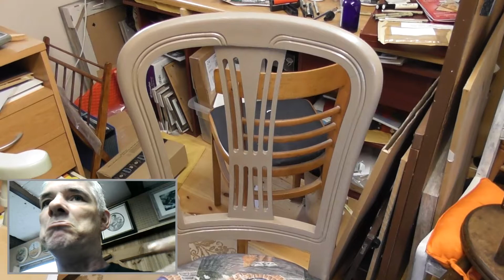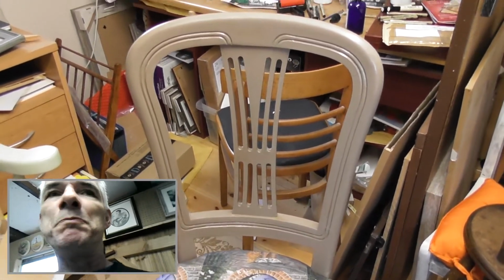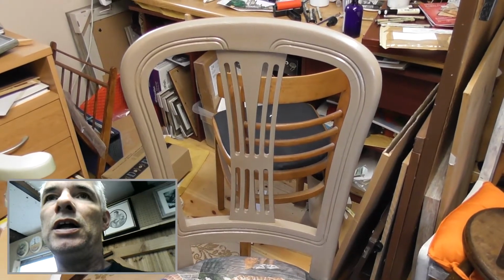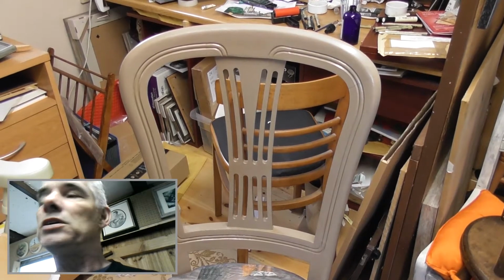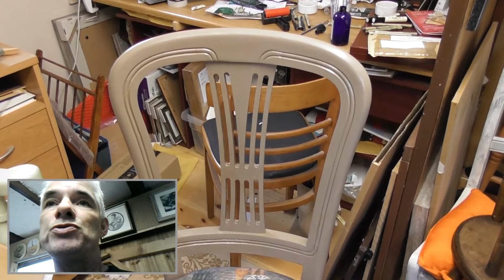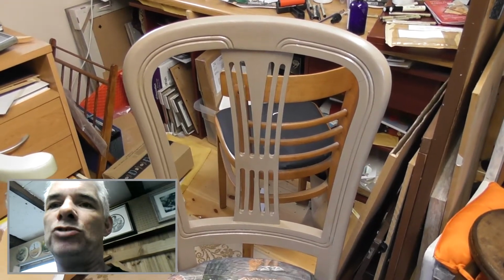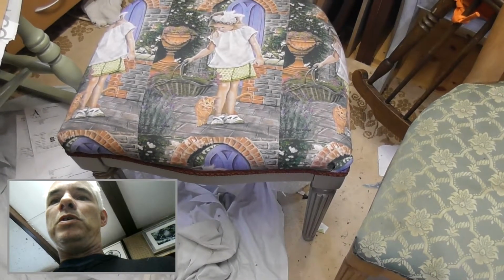So my honest opinion from now on, unless it's a completely brand new piece of wood, and I know it's got no problems, I'm going to prime everything. And then go straight on with the chalk paint. Like I say, it is very true, with Sarah Jane chalk paints or any other chalk paints, you don't need to prime. However, my experience now is it's best to save yourself a lot of work.